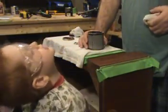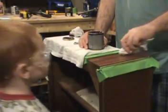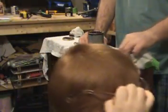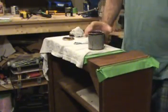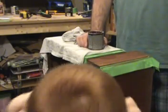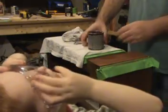You feel good. Now we're going to do the wiping. Okay, and we're going to wipe off the excess. And what's left is our first coat of stain. All right, what do you think of that, Duncan? Very nice. What we're going to do is let that dry a bit. We're going to put on a second application soon.